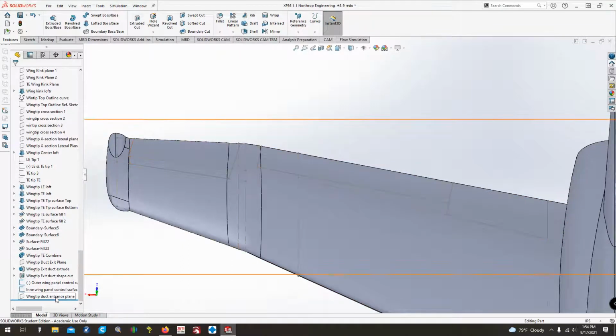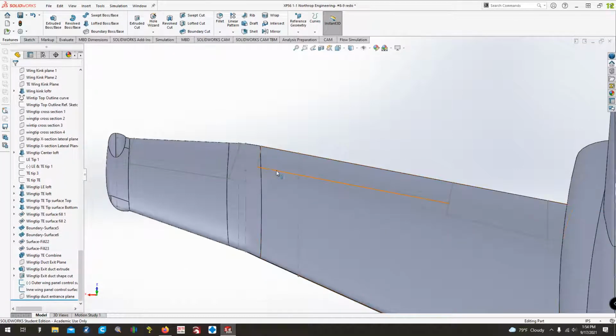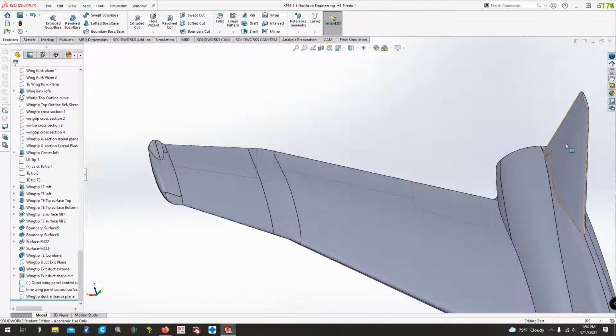So then this inner sketch here, we see we have the elevon, which is this hinge line here aft, and then we have the landing flap on the bottom surface only, and then the elevon is just typical elevator and aileron usage. There were no surfaces on the vertical stabilizer or the ventral fin. Those are just for stability. All your rudder control is out here at the wingtip.